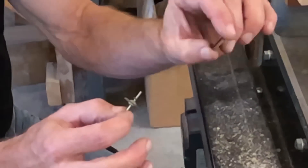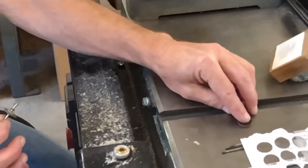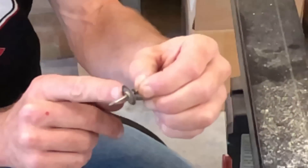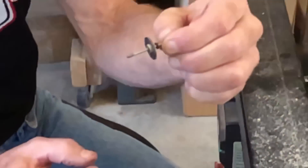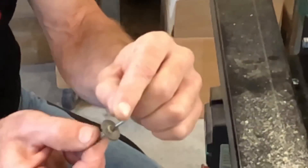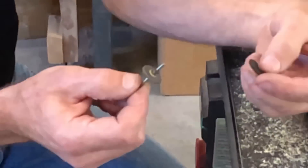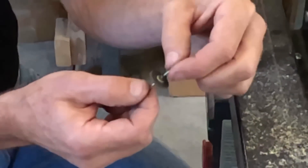The outer valve seat is removable, so that just comes off, and then you'll see three collars. The two lower collars hold the bottom valve seat in place, and then this upper collar is what adjusts the valve travel and holds the top valve seat in place.